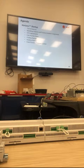In cooling mode. So with the water source heat pump, those valves only operate in cooling mode. I don't let those modulate at all in heating, because if you think about it, it's looking at liquid line pressure. When you're in heating mode, your liquid line drops. It's going to think, oh, I need to close those valves off. But you don't want it to do that in heating mode. So you can only test those valves when the compressor's on and the reversing valve is engaged.